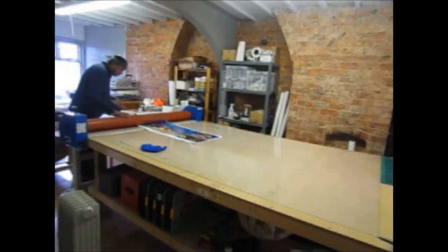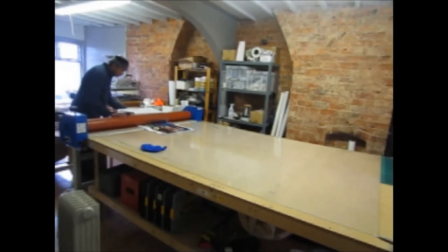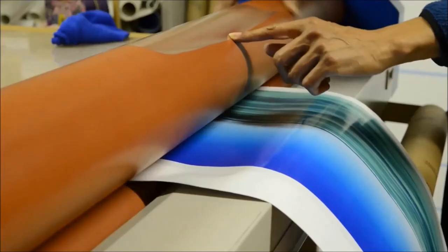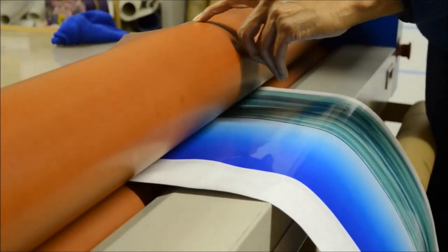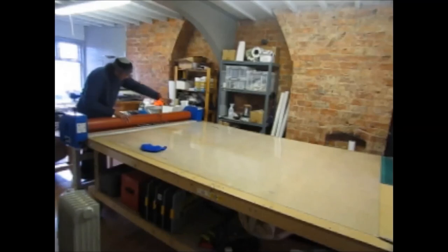Keep it as a continuous feed — roll the paper up as you go and keep where it joins the laminate on this side. We're coming through now; it's picking up slightly but you can just push it down and carry on. Coming to the end where the laminate finishes, I pull the paper off and the laminate wraps around the top of the roller. I put my finger on the very end of the laminate so it doesn't fall onto the job and crease, hold it all the way through, then let go — making sure not to trap your finger. Once done, feed it back in and run it all the way back through.